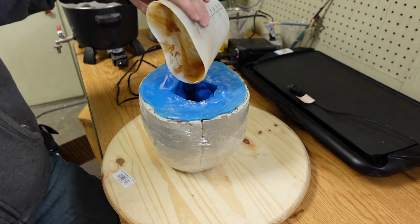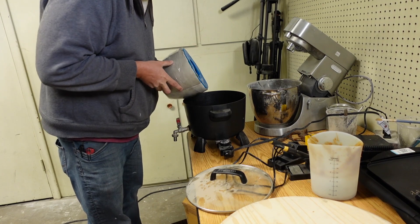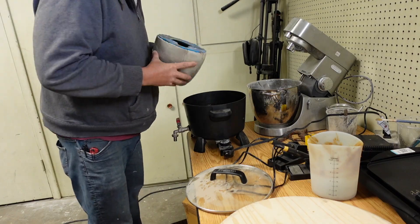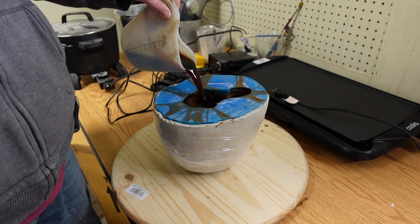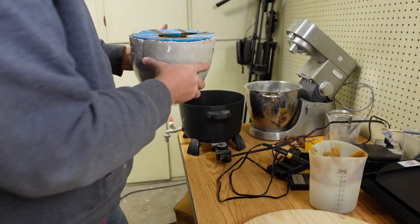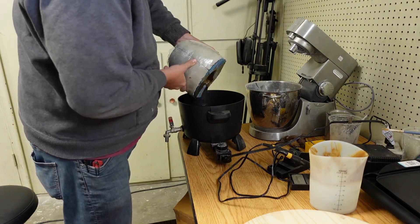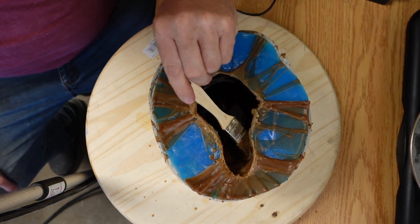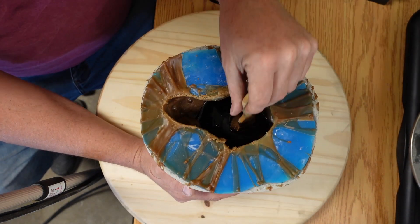To get started we're going to be creating a wax shell and just build up layers using our wax. This is a wax pot that I made out of a fryer — you can actually just buy them this way on Amazon. I pour it into a silicone pitcher measuring cup device. I'll stick my mold in the freezer between coats just to build it quicker, so that the wax isn't melting the layers you've already put in when you're building your layer.